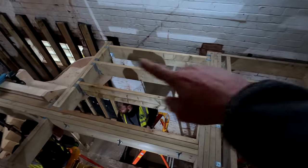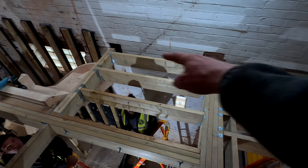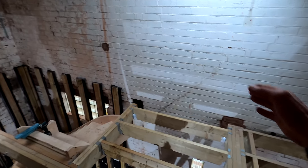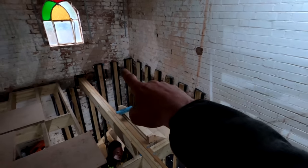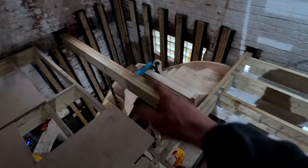We've got the rest of our joists in here. It does look a little bit angular compared to the wall, but that's because this wall, like I mentioned before, is all over the shop. Everything's all parallel running back here — once that carries through, this will all be squared off nicely. Next step, the lads down there are just getting the noggins in — they're going to get all these noggins in all through here. And then I'm going to start getting some floorboards down up in this area.